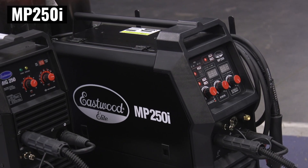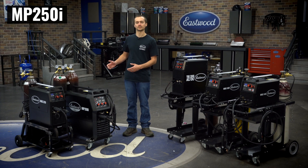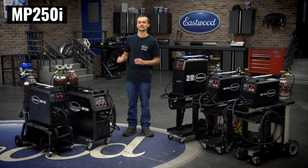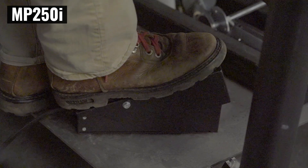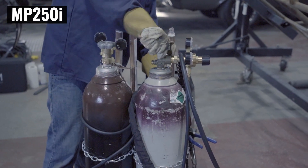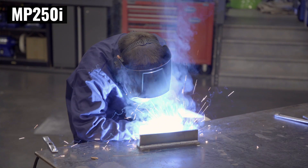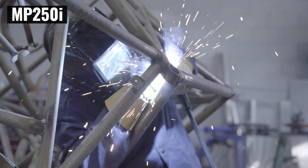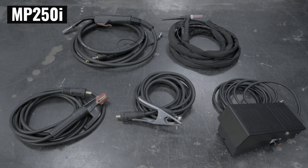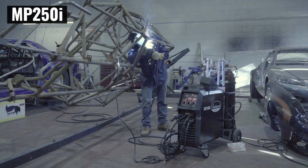Finally, the Elite MP250i. We've had an MP250i for a couple of years and it was a great multi-process welder, but we decided to take a clean-sheet design with the new Elite MP250i. We were looking for true TIG welding capability — easier to use, easier to set up, and easier to swap between processes. This machine is now a true DC TIG welder with a foot pedal, high frequency start, and its own gas system. That means you're not having to swap bottles between MIG and TIG — you can keep your 75/25 gas for MIG and your 100% argon for TIG all set up and ready to go. When you switch processes, it switches gas systems automatically. The MIG side is a lot like our MIG 250 — you can weld up to half-inch plate, it takes a big spool, it's got a really long torch. It's still dual voltage, so it's portable. This machine is pretty unique and special — it's really nice to keep in your garage for a variety of welding processes.